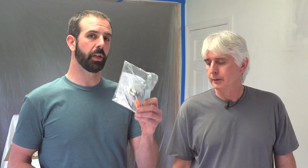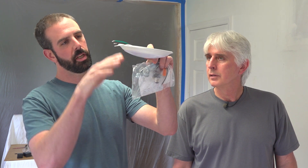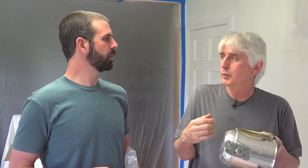These houses are going to be here long after we're gone, and they're going to adapt to new technology. Everybody's going to LED because it's so much more efficient. Kichler has a handy little retrofit kit that gives you the spring clips to clip it into the recessed trim, a socket adapter, and then you wire-nut them together. You've got an LED downlight that mounts right on the ceiling, barely sticking down about an inch, with a nice sleek design. They throw light out to the sides — unlike older recessed lights, these have an extremely wide angle throw.